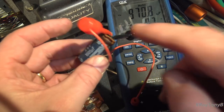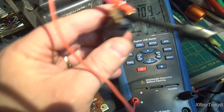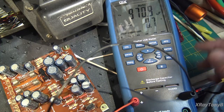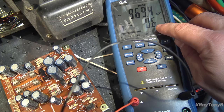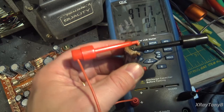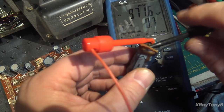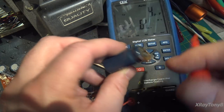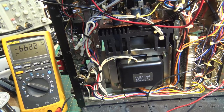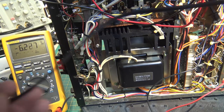Just pulled the first cap. You can see how cruddy it is, but the capacitor itself is still in good shape. It's a 1000 microfarad and reading at 971 — pretty good. The ESR is 0.6 ohms; it could be lower, but this cap would still work. We're still going to replace it because this glue is just so bad — it tarnishes and corrodes these wires, and will corrode them right off eventually as it dries.